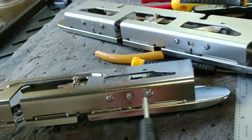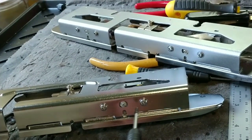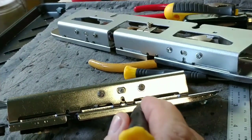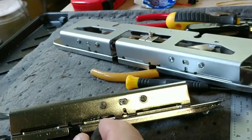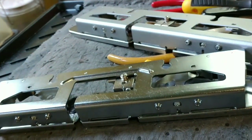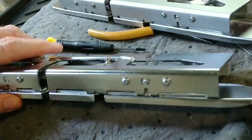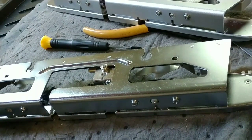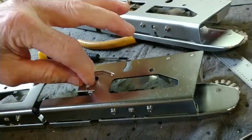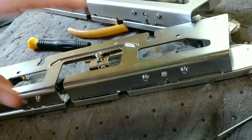We're going to take some precautions. The thing is, we're not going to tighten these screws down like we're trying to keep bears in a pen — we're just going to get them tight. If something got in here, just like I did with my screwdriver pulling through, it might tip it. So those are the adjustments we found on this particular sinker plate. What we did find is there's very little adjustment in this lace carriage — the carriage itself is quite simple: two paths, one or the other. There are some things that'll stick, flippers and spring loads. But most of the meticulous adjustments are here on this sinker plate. That's why we're trying to pass this on.